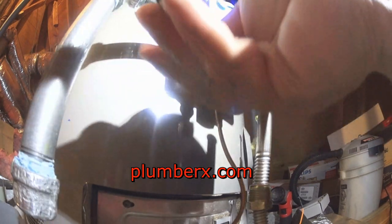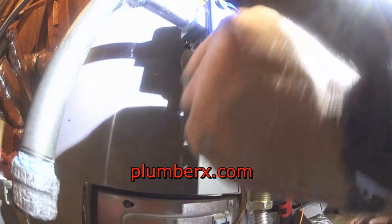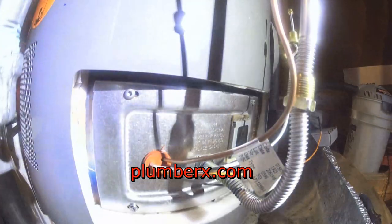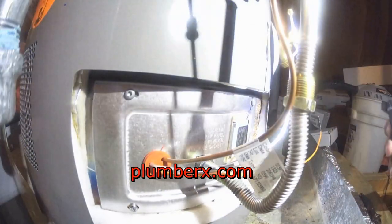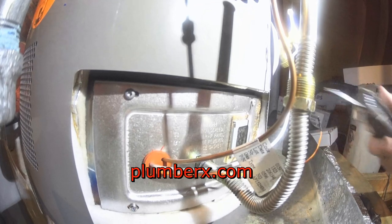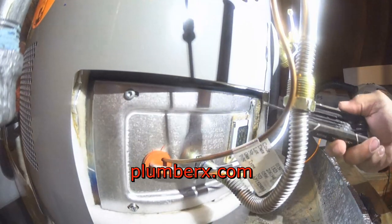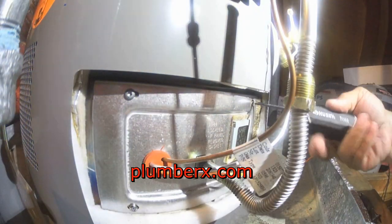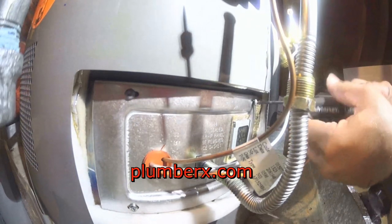So I did go over there to give him a hand, and it so happened the supply house gave him the parts that he needed, but he didn't realize that the little glass tubing that held a little oil in it was the problem. And when that little glass tube pops, it holds the device in place. Once it's popped, it releases that device, and that device shuts down the water heater. And that's only when the water heater is overheated and the burner is starting to burn out wide.